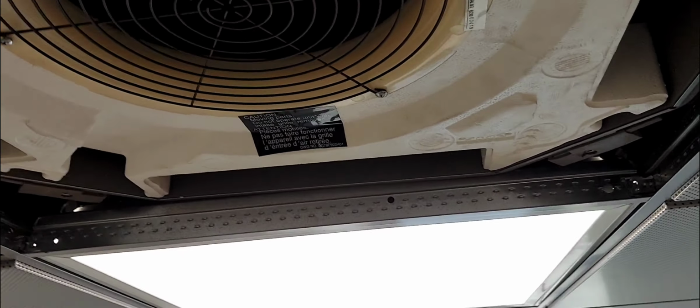All right, so this is already loose. My four screws have already been removed. Four screws are out. So take your time. Actually, it's plastic up above the fan. Yeah, there you go. Where is the drain sensor? Okay, that is a thermistor. So it's not a float, it's a thermistor, right there.